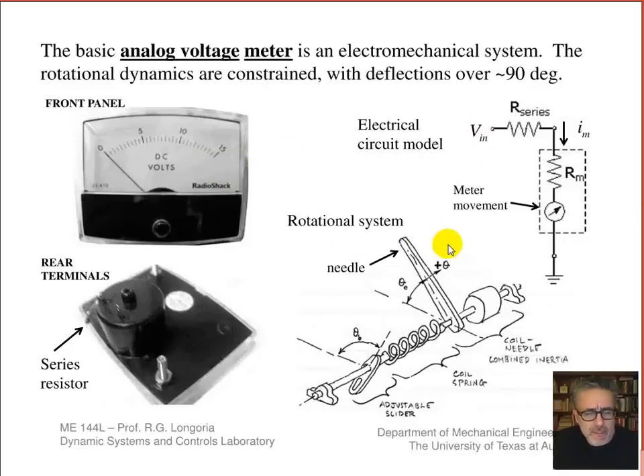It's a nice device because we'll talk about how it works statically with a DC voltage, but really when you put in a DC voltage there is a dynamic response — a vibrational dynamic system. Within this meter movement there's also a little bit of inductance, but it's very small. We'll talk more about this model in a subsequent lecture. The needle is what we're interested in tracking in terms of its position. It's very light, so we can't put other sensors on it, and so it's the motion of this needle that we want to measure using vision because it's a non-contact measurement.